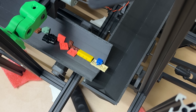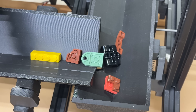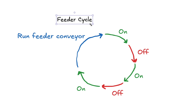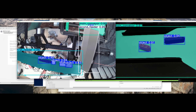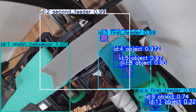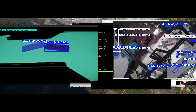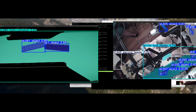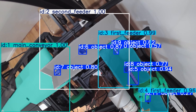Around this time I had what was my best idea yet. Although the vibration handles some of the separation, particularly stubborn pieces need to be separated where the first hopper dumps onto the second. But once they've fallen down, it's really important they get out of the way before more pieces arrive — otherwise we're right back at square one. Previous designs used a simple routine pattern to control hoppers: pulse on, then off, on, off, repeat. If you tune that well, the feeder works most of the time, but not all the time. So what if we put a camera above them, do some computer vision, and get real-time information — is there a piece in the way, do we need more pieces from the bucket, has a piece fallen onto the main conveyor? This is done with a custom fine-tuned YOLO model, small enough to run at about 15 frames per second on a laptop, giving us close to real-time information about the state of the feeder. The vision control works really well to prevent dispensing more than one piece at a time.